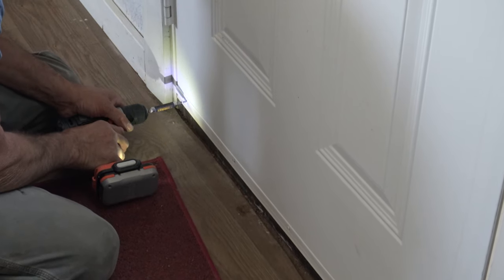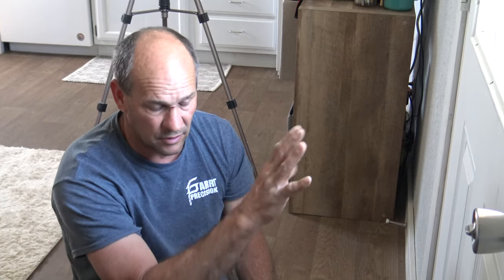Last one. That was super simple. This seal had been leaking for a long time because that piece was actually torn off — ripped off. And no doubt we're going to have to replace this one eventually. But knowing how easy it is, and now that the holes are all pre-drilled, nothing to it. I think the part was ten bucks. And it'll actually save — when we have a big storm coming in from the north, and this particular door is on the north side — it'll keep water from coming in and making the wood damp, ruining the jamb and rotting the wood generally. Yeah, super simple, easy fix. Shouldn't have put it off that long.